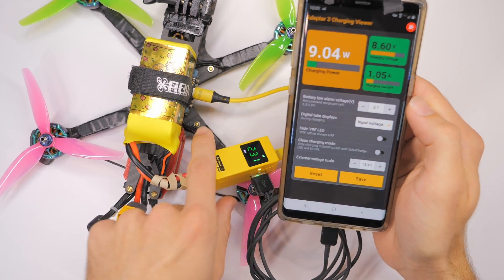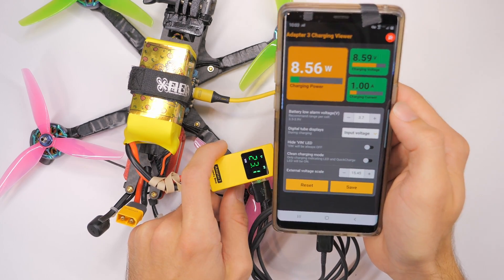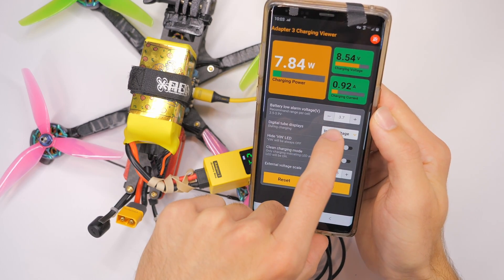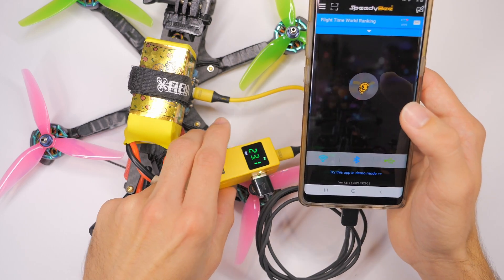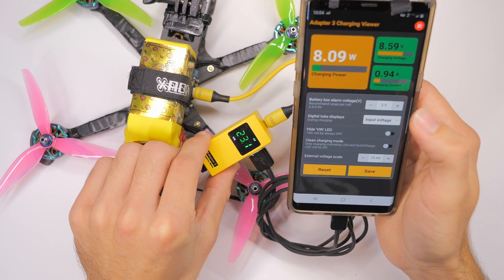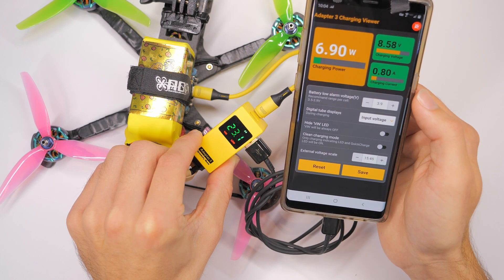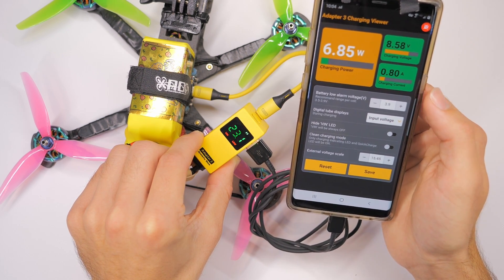So that is actually kind of useful. On this cell checker you can make it alarm at different voltages. It won't display the individual cell voltage because it's not connected to each cell — it's just connected to the main output. But once the main output voltage gets to or below whatever it would be for 3.7 volts per cell, it will cause an alarm to happen. As a test, let's set the battery alarm voltage as high as we can to 3.9 volts and hit save. Now we get a little alarm — that's the alarm you will get when the voltage gets too low past the threshold you set for each cell.